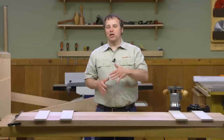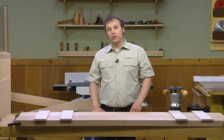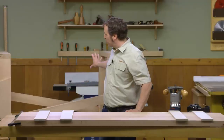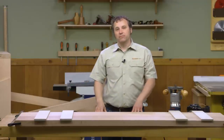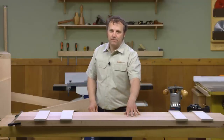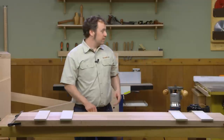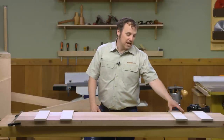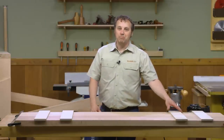One of the beauties of this workbench design is how as each part gets added, it makes the whole thing stronger, just as you saw with Chris making the base. For this section, I'm going to be adding the top, which includes wide aprons on both the front and the backside of the bench. Chris cut a notch on the front edge earlier, and now I'm going to cut a dado on the inside faces of these apron pieces to fit over that notch and wrap around the legs — locking everything together.